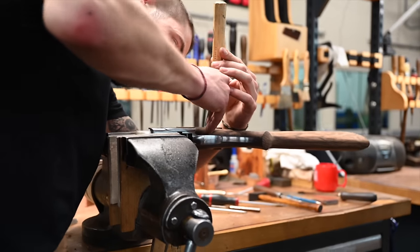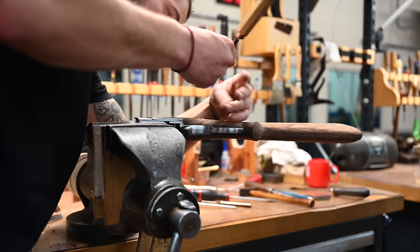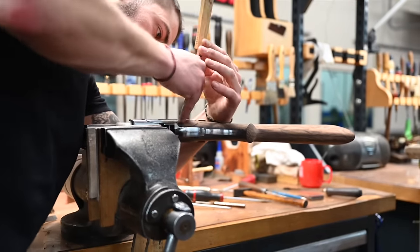So we don't want to deliver the gun straight away after that. If it can stay a couple of weeks in a controlled humidity environment, it's the best, because the dangerous moment is the wrapping, in fact. You use a silk paper to wrap it. We hope our customer removes the packaging straight away when they receive the gun to make sure the oil can breathe for as long as possible. So if you want perfection, you have to wait.